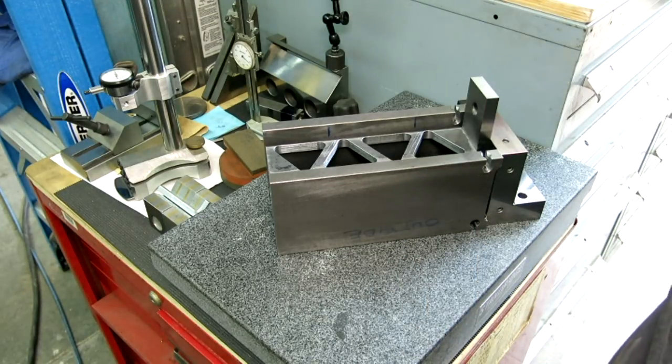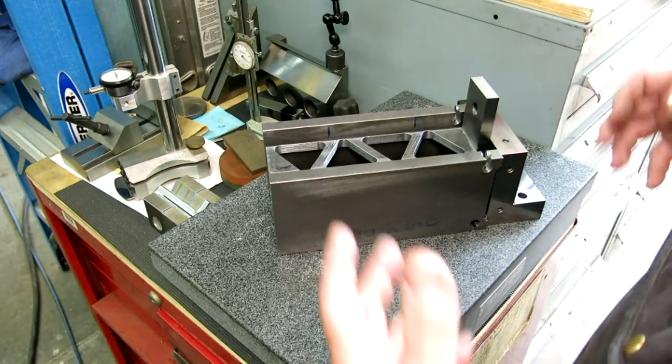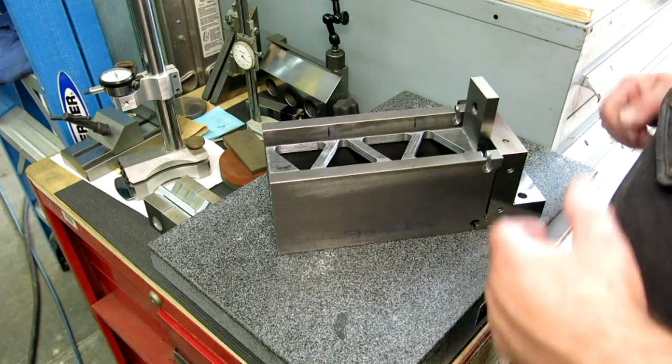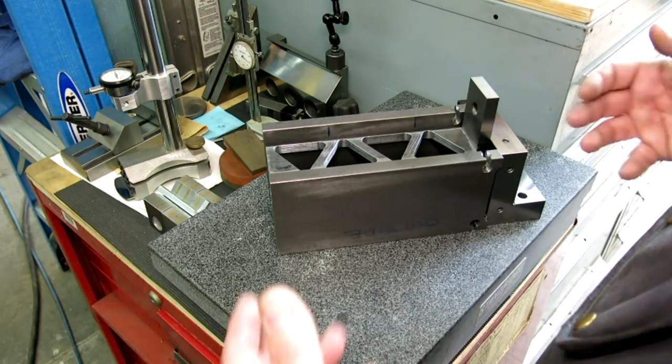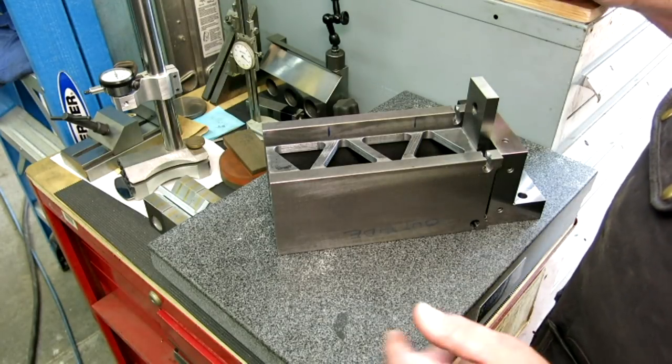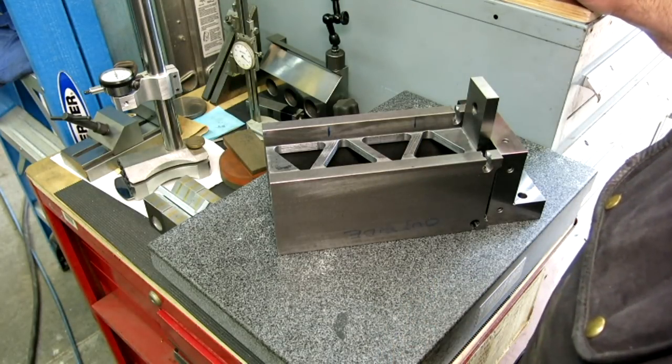It doesn't need to be welded continuously. We just have to hold it together permanently, obviously, and it has to survive the carburization process too. So we want pretty good welds on there, and it's all steel, so it should expand and contract at the same rate. So theoretically there's nothing that wants to tear it apart.